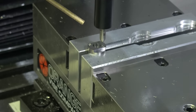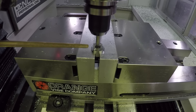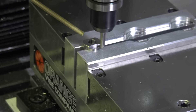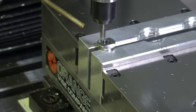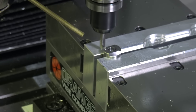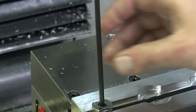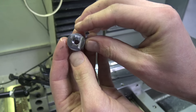So I've got a 4-inch diameter and a 5-inch diameter Versagrip. I was actually thinking with some of the smaller ones I might be able to get four radii per piece, which would be sweet. Here we're using the 2D chamfer CAM feature in Fusion 360, which automatically detects the solid model and adjusts how far around it can get the chamfer without having the shoulder of the tool gouge into your model. All I want to check is to make sure my cap screw fits — and it does. This one's got the goof from our first Superfly, so you can see that line there, which I bet you the next one won't have. I think that looks pretty damn good, though.